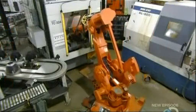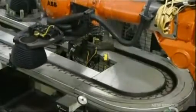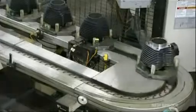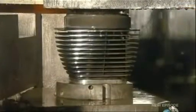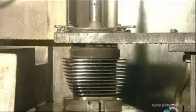To make one, a robot loads a cylinder into a machine equipped with cutting tools. The tools mill the cylinder's metal slats to highlight them. The slats are called cooling fins — they allow the engine's heat to dissipate. A cutting tool then bores into the center of the cylinder, carving it to precise dimensions to allow engine components a perfect fit.